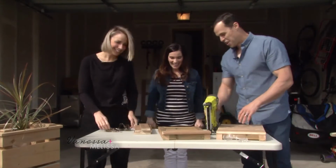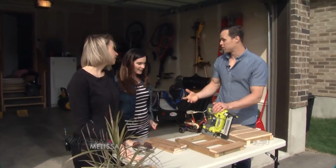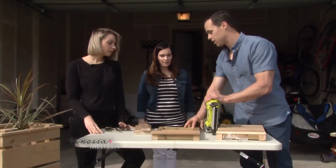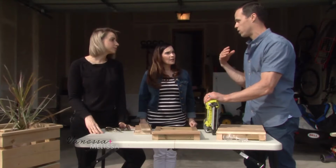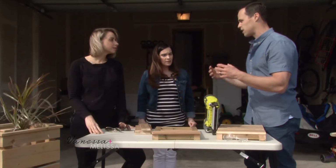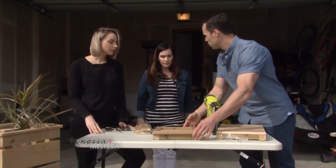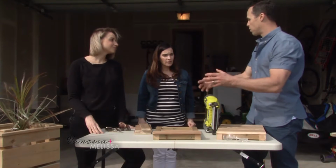Straight lying. All right. So I must note that I'm very eco-friendly also. We have a low VOC pressure-treated lumber that just came out. It's called Micro Pro Sienna. This is awesome stuff because if you want to have a vegetable garden, you can now, and you don't have to think about only red cedar or white cedar. Cedar was the only lumber we could use before because it has natural tannins in it that allow it to not degrade. Pressure-treated lumber was our other source, but green pressure-treated lumber you would never put a vegetable garden in because you don't want the chemicals to leach into the soil.